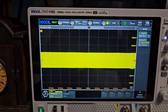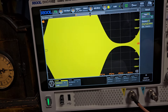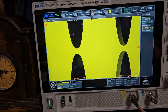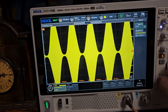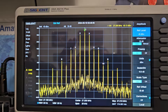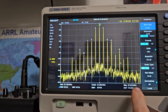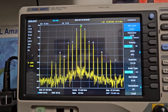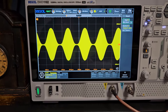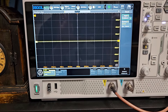You don't want to go too much here because you can work against yourself if you take it too far — it's still nice and round. Bringing that down into perspective: there it is on the 20kHz span. It's pretty clean. Your next complete frequency is over here. Personally I would probably run it a little less, but a lot of guys want the mod. You can always turn the mod down on the radio. If it's a little too hot, back it down from 36 to about 20-25 and it'll clean that up, but it's not terrible — we've seen a lot worse.